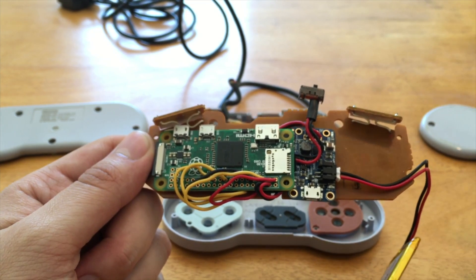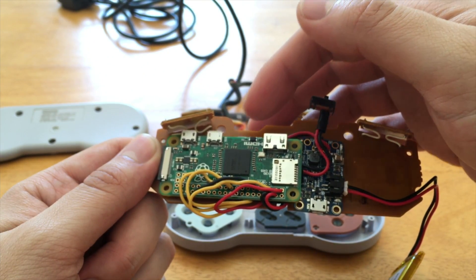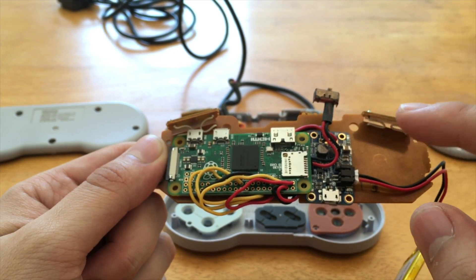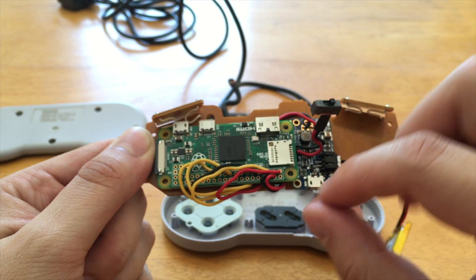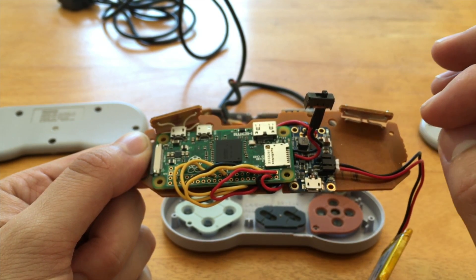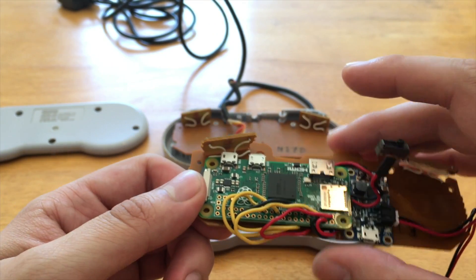Some things this doesn't do — there's no space to easily access the Pi's ports, so if I want to add more ROMs or games I have to open it up, which isn't terrible since you won't do that often. Once the power switch is hooked up, the next phase is wiring the Power Boost to the Raspberry Pi — the positive and negative pins map to the 5-volt and ground GPIO pins on the Pi. Once that circuit is complete, the Pi is powered and you can do anything with it.